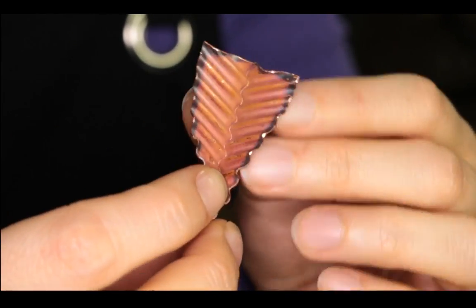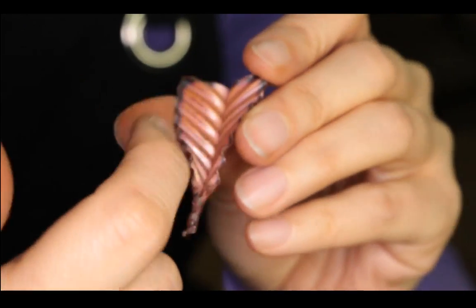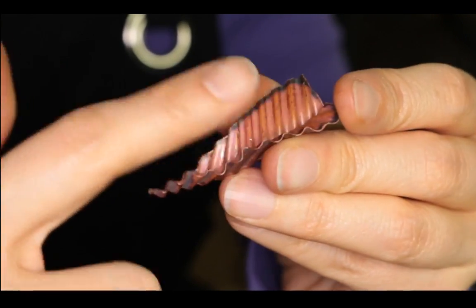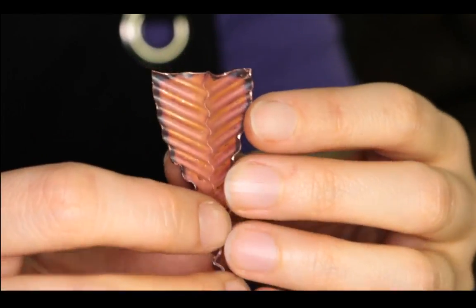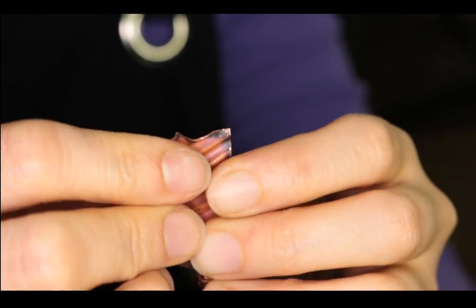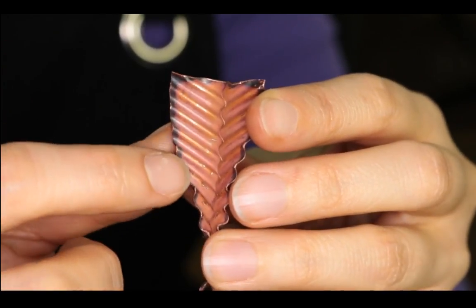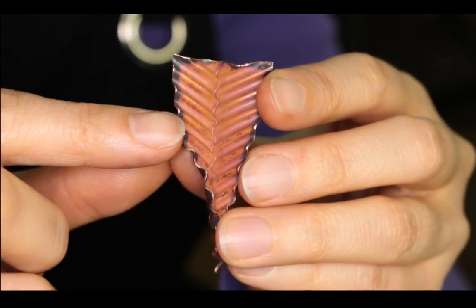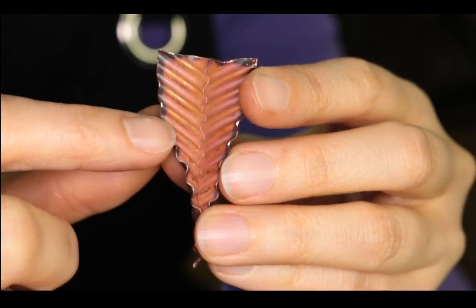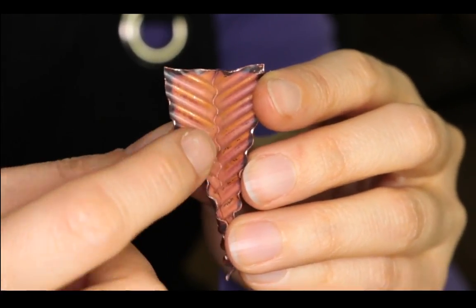So you will need something like the 3M bristle brush to smooth it out a little. A 3M bristle brush usually does it better than you can with sandpaper. With sandpaper, you only get the raised part, because it's hard to get to the valley, like hills and valleys here. So the valley is kind of a hard-to-reach area, and the 3M bristle brush would clean it up better.